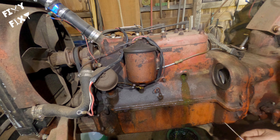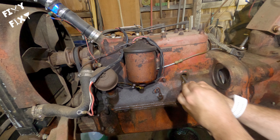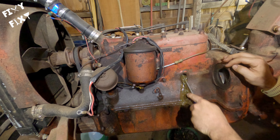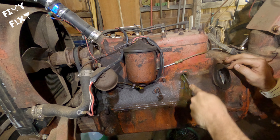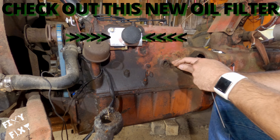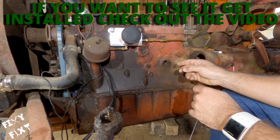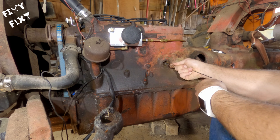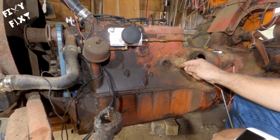At some point I ended up switching to a piece of metal wire, and I fished it around the cylinders as best I could - that's all I ended up doing, just so I could replace the freeze plug cap. It was awfully helpful for getting around the bends of the cylinder walls and scraping across the sides of the block to get little bits of debris out that I couldn't quite get with a screwdriver or a ring seal puller.